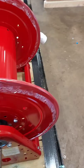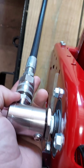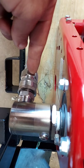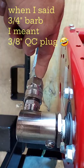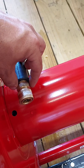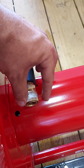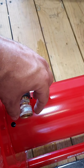On your hose reel it will come generally with a half inch female pipe threading. You can use a hex bushing or a quick connect that fits into this. In this case we used a half inch MPT by three quarter inch barb that goes onto a three eighths quick coupler that's female pipe threaded and attached to the whip line — this is where the pressure comes out. Your inlets are generally half inch, so you either need a half inch male pipe threaded quick connect that's three eighths, or a three eighths to half inch hex bushing and then a three eighths by three eighths quick connect. We like using the proper quick connects so that we don't have what we call a Christmas tree — additional unnecessary fittings. This is your pressure hose reel; you simply bolt it down and mount it.